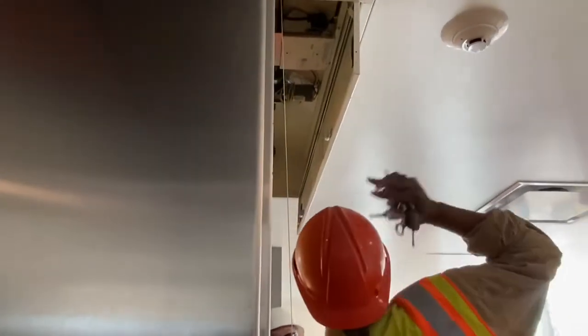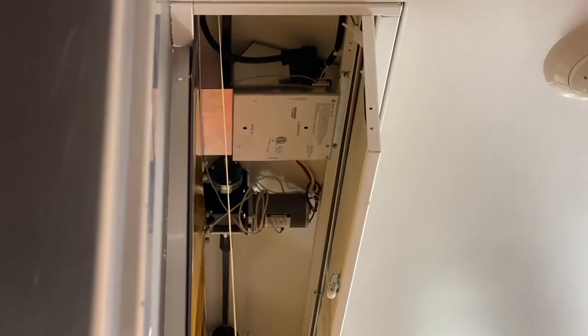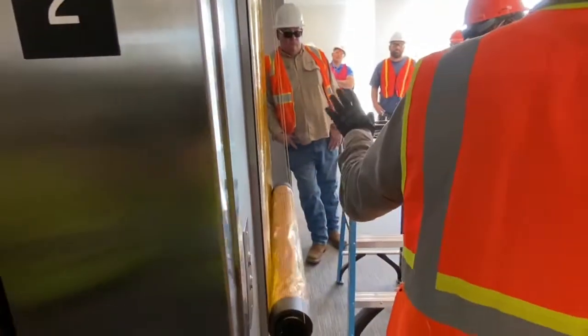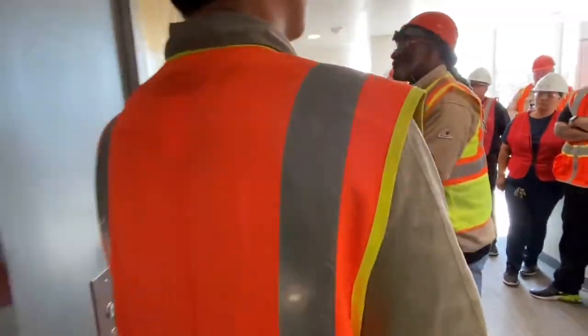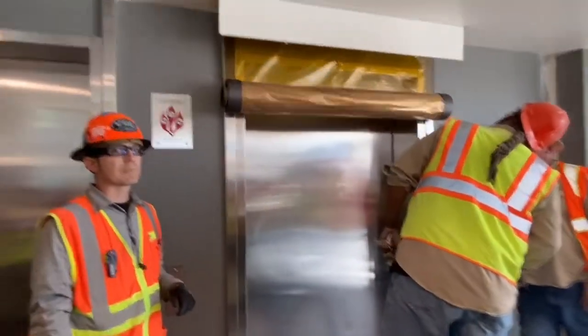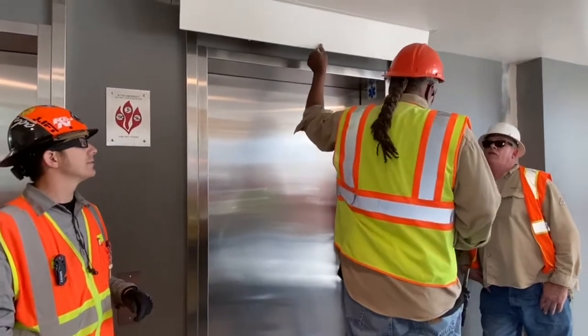If we have an actual alarm or false alarm, we wouldn't be touching that toggle switch — we'd just be hitting the button up front. Yeah, if the alarm did go off and this thing came down, then you would press that button and not touch the toggle. That's for testing purposes only. If the building's still in alarm mode and you push that button, it'll roll up but it'll come right back down. Somebody has to reset the alarm for it to stay up.